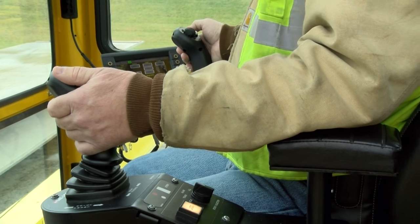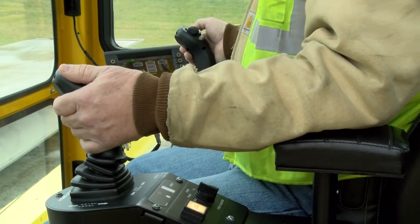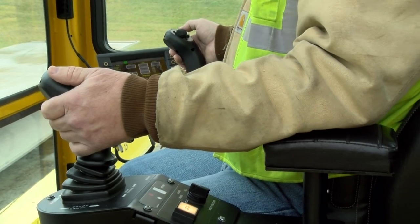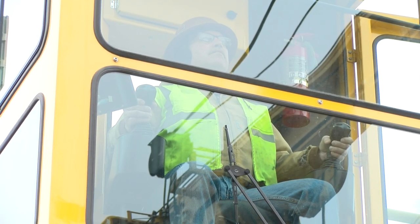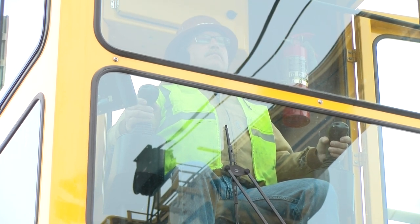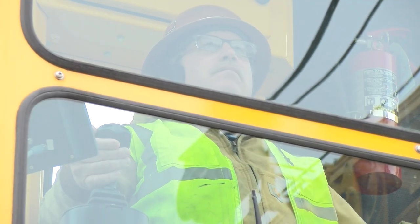The front and rear hoist can be operated independently or simultaneously. The chain-driven traverse system moves the trolleys along the top beams, utilizing a parking brake for holding the load while the traverse system is not operating. Each individual traverse system is powered by a hydraulic motor, and like the hoist, each one operates independently of the other. The operator's cab is typically located on the left side beam and, depending on the crane's application, can be positioned at various heights and locations.